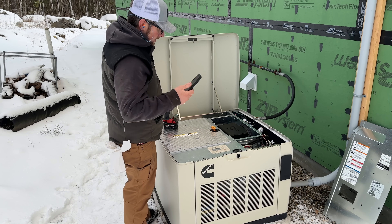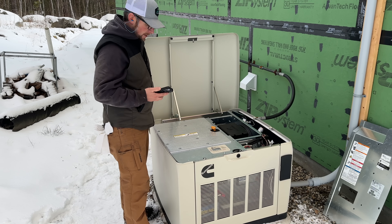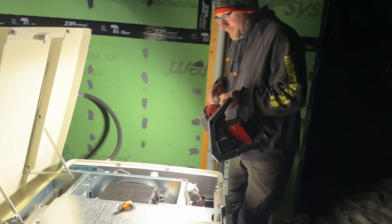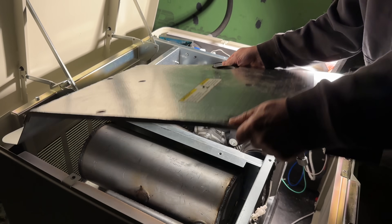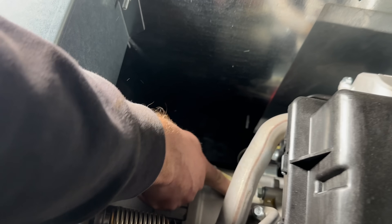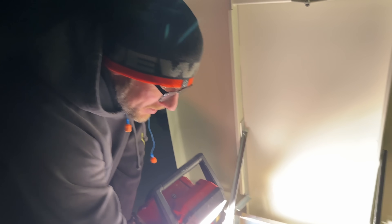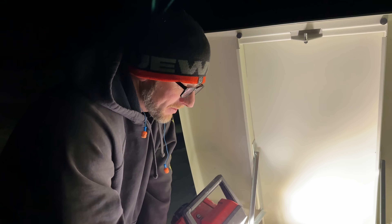Let's fire it back up and let it run, then come back out and check it. We had the generator running for just over an hour. There is a little bit of oil — interesting. All that is wet with oil again, but I'm not sure where it's coming from. I'm going to clean this all up, run it again in the morning, and make sure I get the dipstick tube cleaned up really well, because I'm wondering if it's coming out of the dipstick tube and running down.